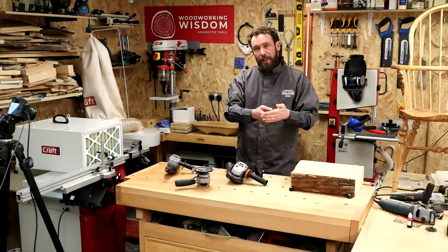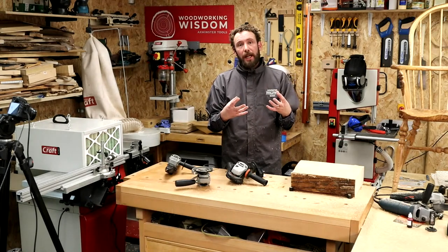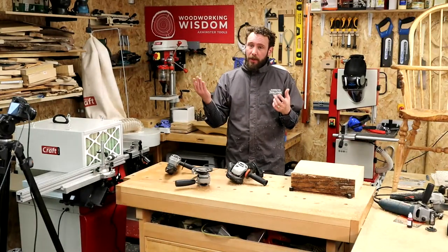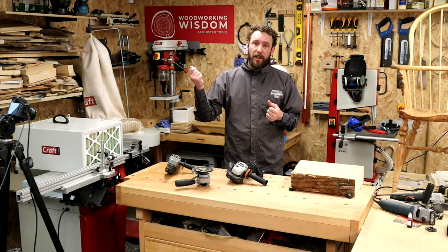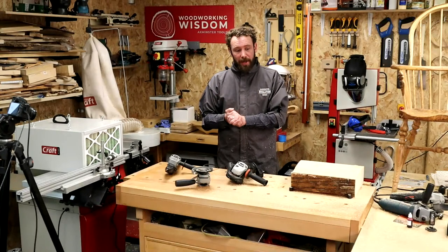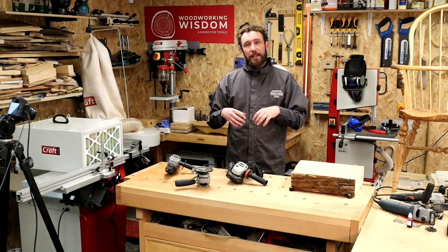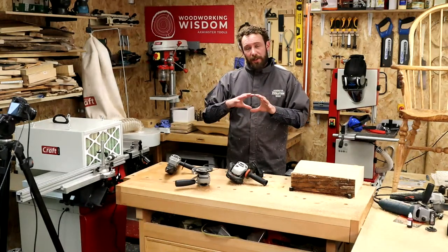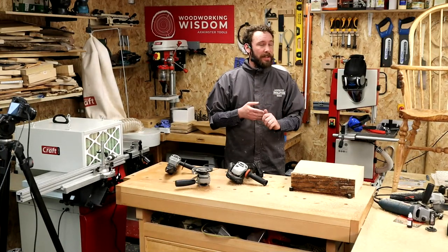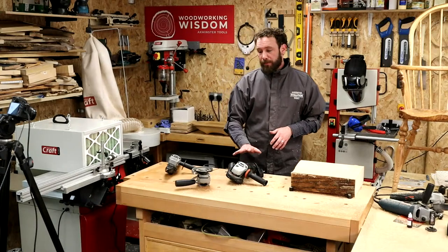As soon as you get two or three inches away from the main body, the main bulk of your octopus or whatever it is that you're carving, the way it works, that rotary action is going to, the teeth are going to come around and hit it a little bit, and it's probably going to break those off. For things like your tentacles, you probably want to downsize a little bit. Start off cutting them as best you can on the bandsaw or scroll saw, and then bring in probably a smaller rotary burr to do something like that. A little bit too aggressive, this tool.